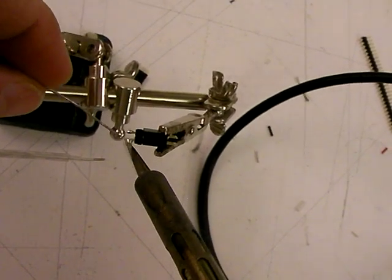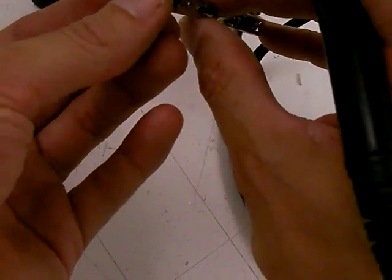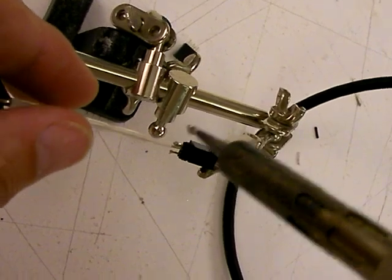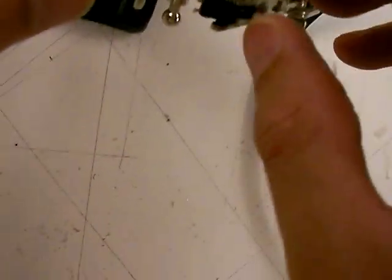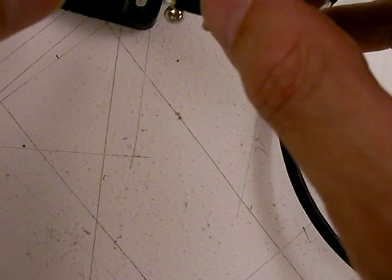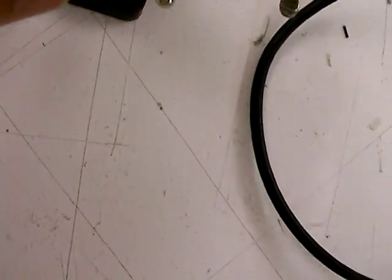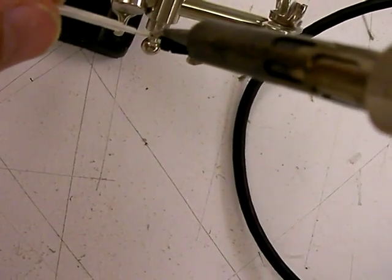It's like I'm doing robot surgery here. That looks pretty good. I don't bother tinning the EL-wire at all — job one is to try to get the core of it kind of connected. I just sit there and get it sort of holding mechanically and lined up nicely. What I like is for there to be a little bit of tension so I don't have to use my fingers to make it all happen.